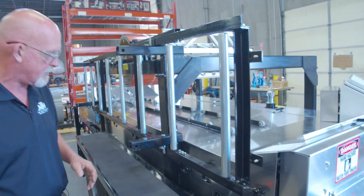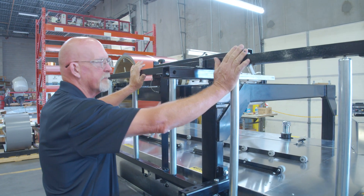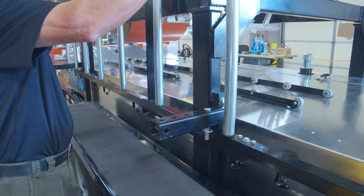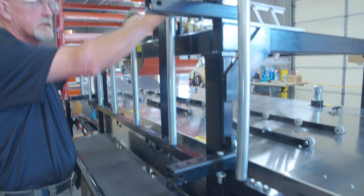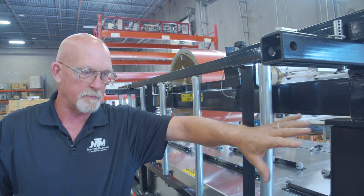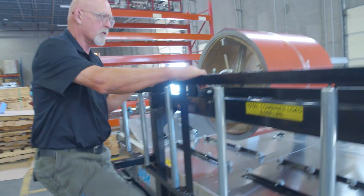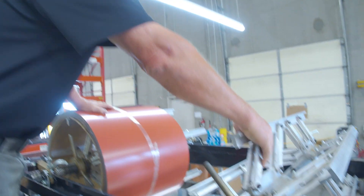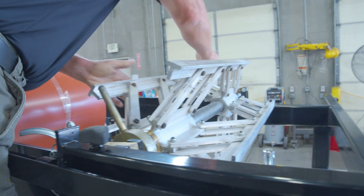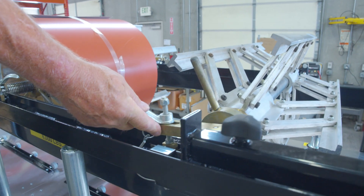Make sure your jacks are all the way up. When safely transporting, make sure all of the pins are in — the bottom pins go down and latched, the top ones go up and latched, so the machine is safely attached. If you want, you can also put a bungee cord around it to keep down some rattling and shaking. When transporting the coil, make sure your decoilers — if they turn — are locked down so they don't spin or come off. Make sure all your pins are in here and latched nice and tight.